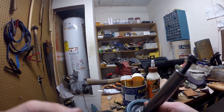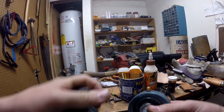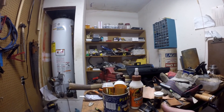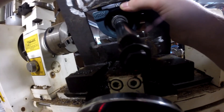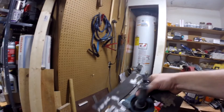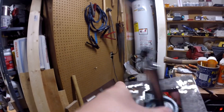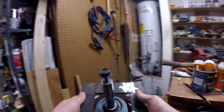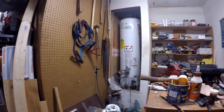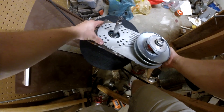Once I have some key material I'll put the key in — although I can't do that on these. On the sprockets I have to though, because they are keyed, but these are not keyed so I don't have to worry about it. All they do is let the thing spin, so all it needs is enough grip to keep the shaft in the bearing. As you can see, this is the jack shaft — it's going to be about like this. If we get the torque converter pretty much centered on here — it doesn't have to be perfect — I can just pick the best hole to put it on.